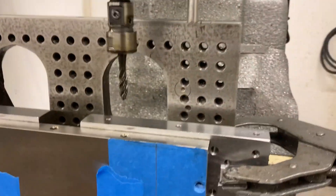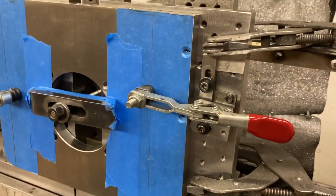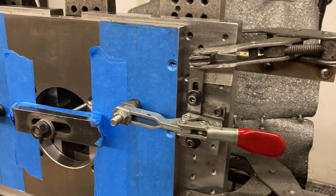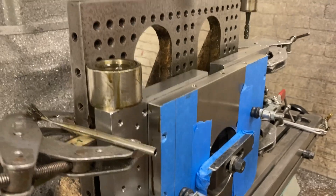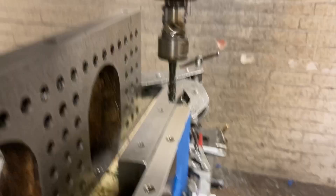So I had to space it out. I'll take these plates that I got right here — they're actually big honking vise jaws that I made. I could screw them right into the vise and use them as an angle plate when I've got small parts to do. I've got two of them, right hand one, left hand one. I'll screw them right to that other big angled knee to space it off a little bit, and have clearance for the tap to come in.